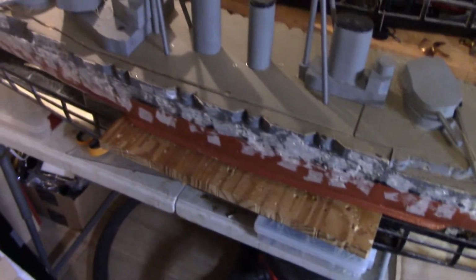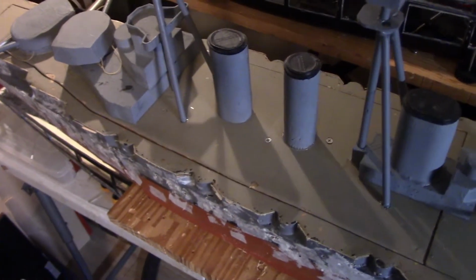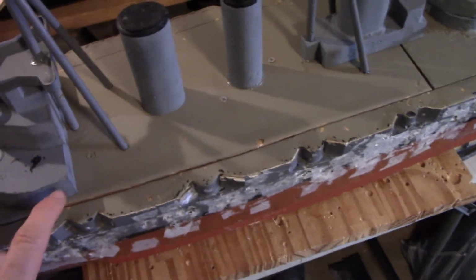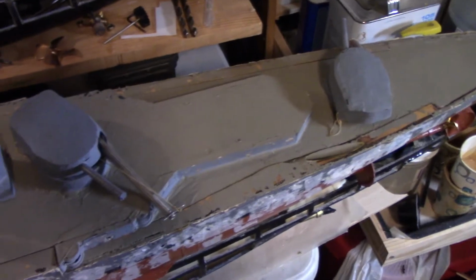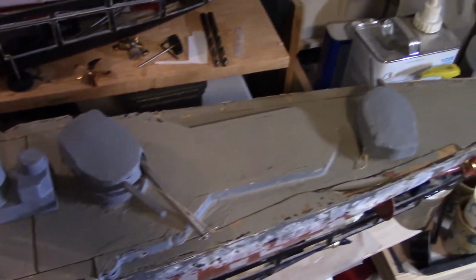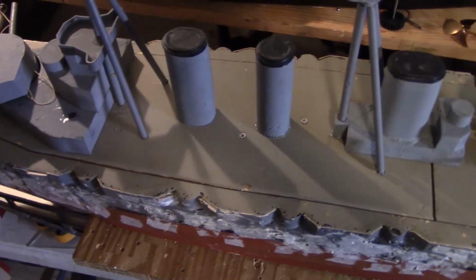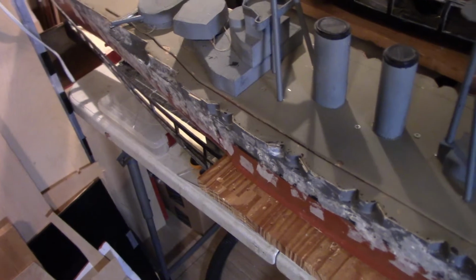One thing I glossed over that's important to figure out is determining what thickness you want to use for the deck and subdeck. The way that you figure that out is you determine what material you want the deck pieces to be, which is this removable piece. And then you also want to have an idea of what method of deck hold down or deck seal you're going to use. The basic rule of thumb would be, like I said before, just use 1/8 inch deck pieces and then a 1/4 inch thick subdeck. You can also do equal, so 3/16 for both of them, if you want a sturdier deck piece.